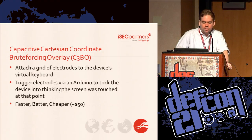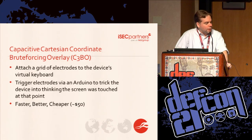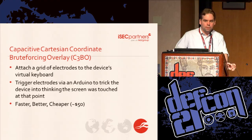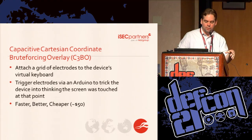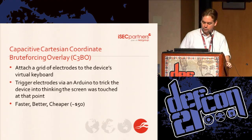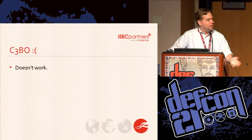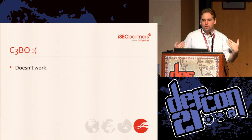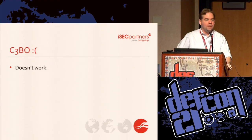We need to ground the stylus to make the capacitive touch screen detect it as a touch. At some point I realized: why not just hook up a bunch of wires to the screen on the buttons, ground them selectively, and then we don't need any moving parts? You use a microcontroller connected to relays to trigger those, which causes the touches to appear on the screen — no moving parts, no complicated calibration, just fire off the Python which fires the relays. Except it doesn't work. The problem is the relays I selected have enough capacitance by themselves that once you hook them up, even if the relays are open, the screen sees it as a touch. I don't know anything about electronics — does anyone here have an idea of what's wrong and how to fix it? If we can get C3BO working by the end of DEF CON, I will give someone a full R2B2.